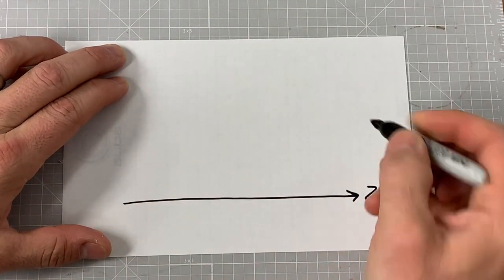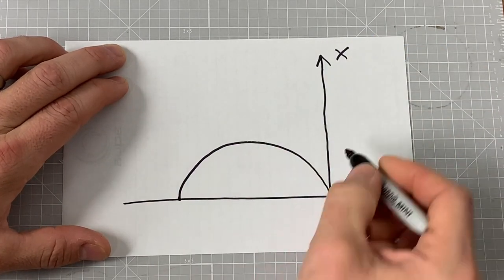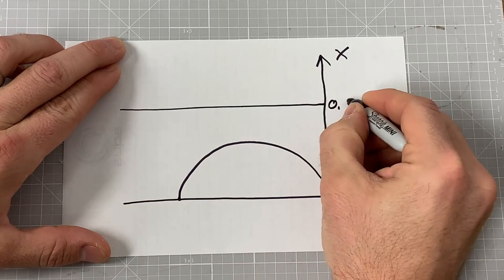So let's sketch out our machining strategy. I always like to look at my turned parts as a profile in the ZX plane, with X being the radius of the part at a given Z coordinate. This makes life super easy when writing G code.